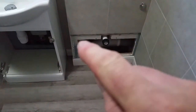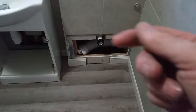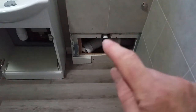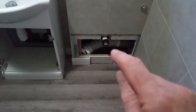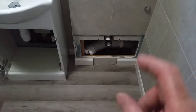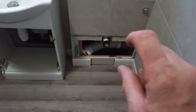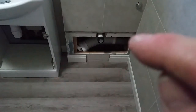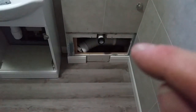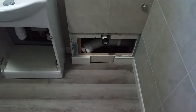The toilet area — I've got to basically cut out some backer board, figure out a way of framing it behind, then I'm going to cut two tiles across and down so that all you can see is tile. These two pieces will be removable. The technique I used in the en suite was to put silicone sealant around the edge of the tile, let it go off, and then push it in — it acts like a rubber gasket to hold it in place. I may well do that again.